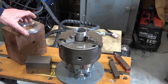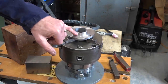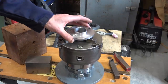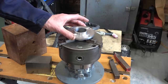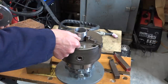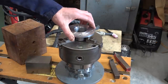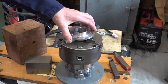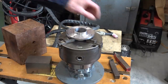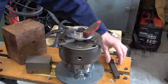At this stage I'm going to TIG-tack this on the back — there, there, and there. Now, this was supposed to be a press fit. It is a press fit just below that line, but there's really nothing in it — only a couple of thou of wiggle — but it's enough to give that a bit of lift when I tack it. So I'm going to put some weights on it and try and keep it down, and after I've done the first tack I'm going to have to check it.